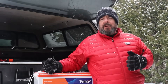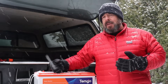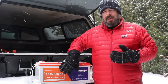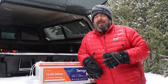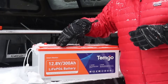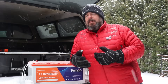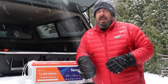Why do you need a self-heating feature? You can use these batteries down to about minus 20°C (minus 4°F), so discharge isn't the issue. The problem is when you try to charge them at temperatures below 0°C or 32°F — you'll damage the battery. The BMS has a low temperature cutoff that won't allow charging at those temps. Some people think the battery heats itself up on its own, but that's not quite right.